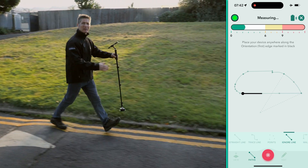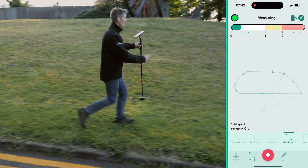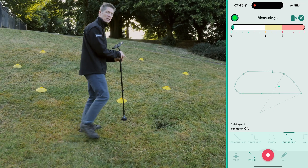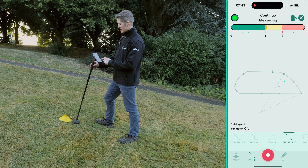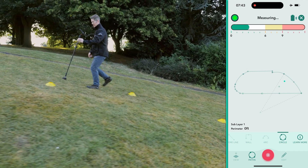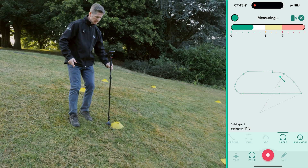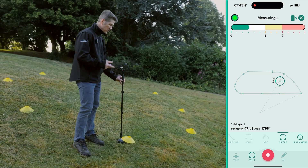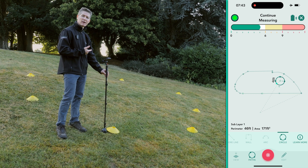The light's gone red again — it's so quick, so snappy. I love it when everything clicks. Green light means good to go. I capture a second point along this first edge — two points anywhere along that first edge will do. Place it down, make my way up to the circle. Now my path type is going to be circle. I've got one point, I need three for circle to work. Watch what happens on the third point — we've got a nice well-defined circle. Three or more will do; I can do another one. You can see it's drawing a best-fit circle through all the points I'm capturing.